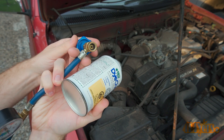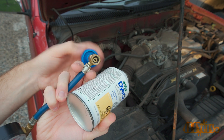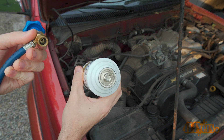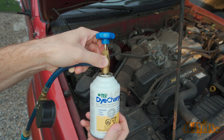There are dyes available to inject into the system and this will be labeled on the can. It's always important to shake the can first before usage. The valve has a punch which is operated by the handle — ensure it's fully retracted before screwing on the can, then screw on the can.